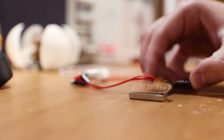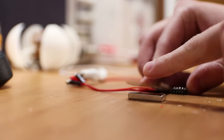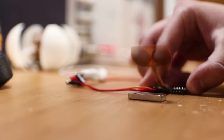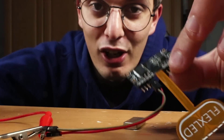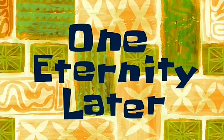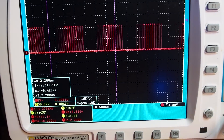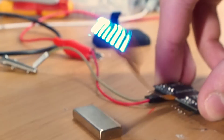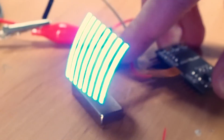Let's see if it flips — that's quite a flip we got there. Now all you have to do is configure the LED driver to turn on the LEDs. One eternity later, finally the LEDs are lighting up. That is all the data being shifted by the microcontroller to the LED driver, and now if we put it on the magnet we should see some holographic action. Whoa, that's way larger than I expected!